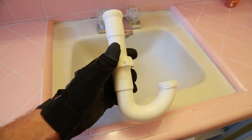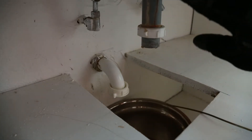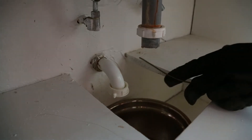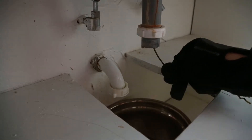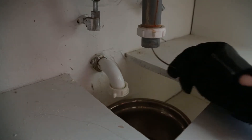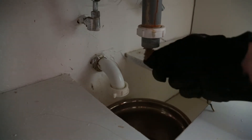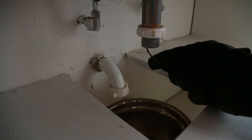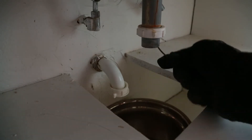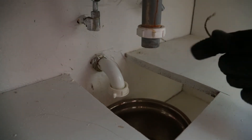With this bit of hanger I have here, I'm going to put it up inside this part that connects to the bottom of the sink and clean out inside there as well. Really gross bits of junk dropping out — disgusting. Definitely worth wearing gloves when doing this. I think that's pretty well got it, or at least loosened up what's there, and when we run the sink again all that material will be flushed out to the sewer line.